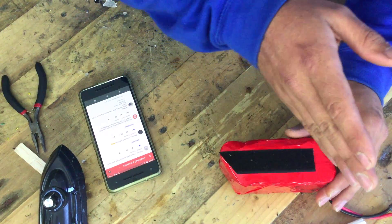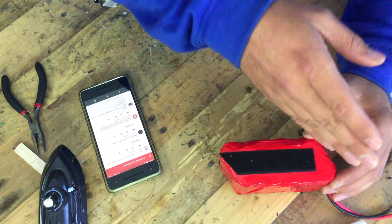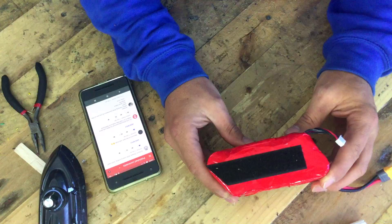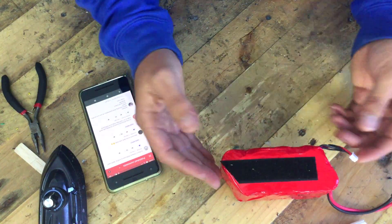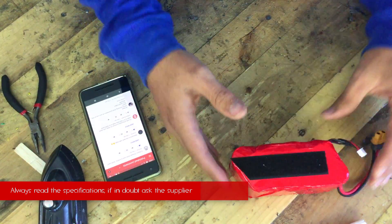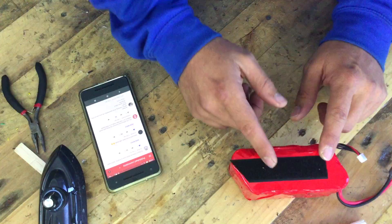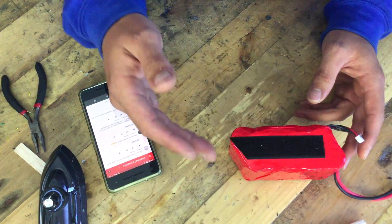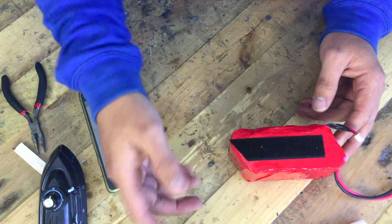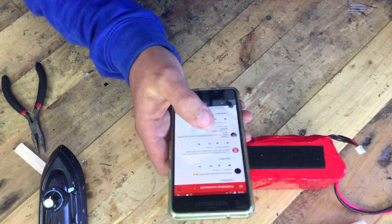These cells go from 2.75V all the way up to 4.2V, which means you don't need a specialized charger. Because the 26650s top out at 4.2V, you can charge them as any normal LiPo battery. I've just been charging this as a normal LiPo pack. The only issue I've had is battery cutoff warnings on the charger — two of my quad-core charger channels had a 5,000mAh limit and cut off short, so I've set them to 12,000mAh to allow charging larger packs like this.